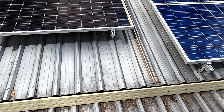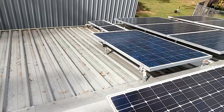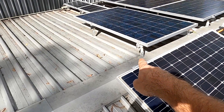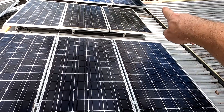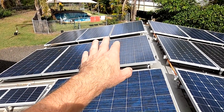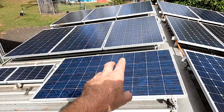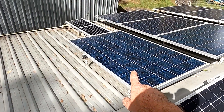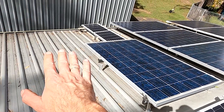I've got one rail already sitting there. The problem is I don't have any feet at the moment. We have to take off this panel here because I need these feet — there are four feet underneath which I need for these two strings to replace them. I've got no need for it at the moment because I'm running a 3S configuration with all my panels. So this is a bit of a leftover panel, but I'm sure we will get others in the future and then we can put this into duty again. I'm not going to put up this panel anymore — I'll leave it down in the garage somewhere until we find matching panels and then we can put more strings here on the garage.